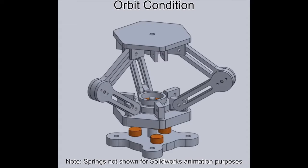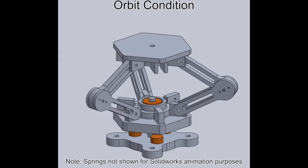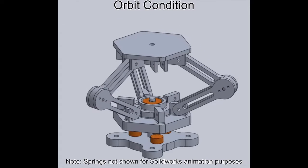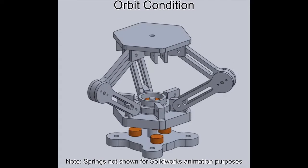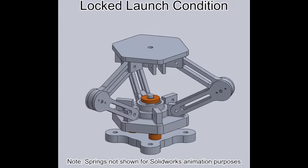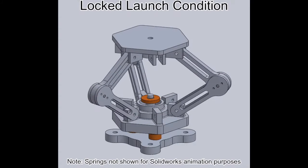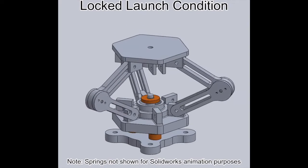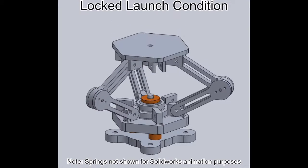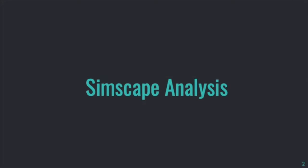The pedestals are 2-stage vibration isolators, which change their natural frequency and damping based on passive contact during the satellite launch. The pedestals are made primarily from aluminum for its lightweight and machinability, and Garolite for its impact resistance. The 3 aluminum plates were designed to be CNC machined, while the remainder of the components are manually machinable or bought off the shelf. Now I will talk about the block diagram for the pedestal.